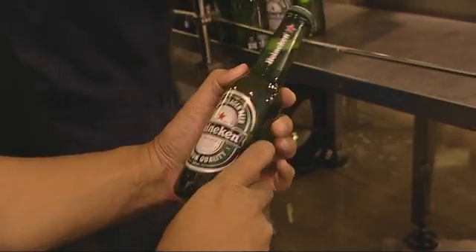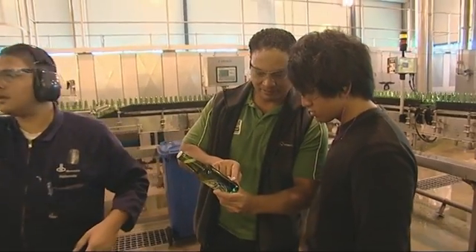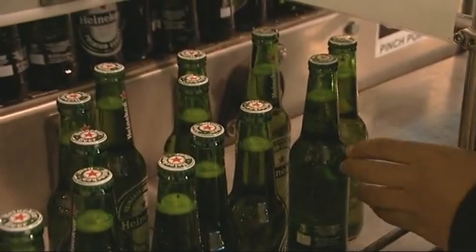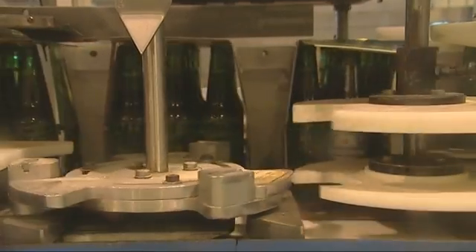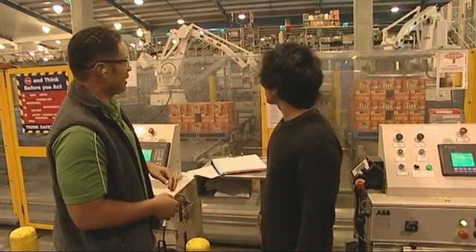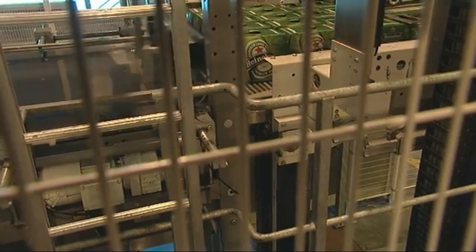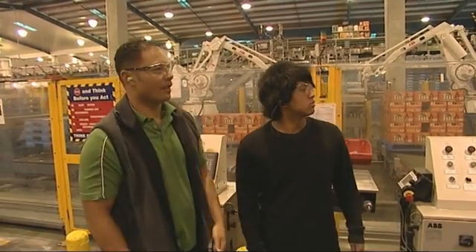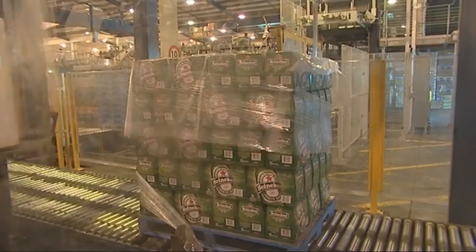What you're going to look for: front label, neck label, back label, and that's the date code — just make sure that you've got a printer in there with the date code on. All of these bottles here, you can just put them back onto the line. After the bottles are put into packs, they head off to be stacked and wrapped. OK Harrison, we're at the final end of the production line — this is what we call the robot or palletising area. What happens here is all the finished boxes get stacked on pallets, layer upon layer. A drop sheet is put on top to protect the pallets from dust, and we wrap up the pallets to give them stability and protect them from the elements.